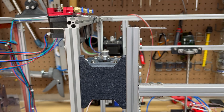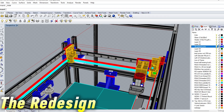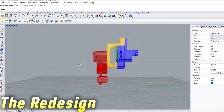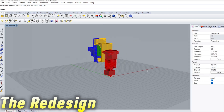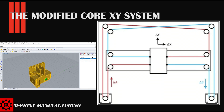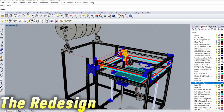The new mounts are a lot thicker and had greater gantry support from the plate that the stepper motors mount to. So when in doubt, make them thicker. With the stepper motors in place, I still had to come up with new printed mounts that would hold the linear rails in place. All the blue parts are going to be required to hold these rails to the frame and also the gears and pulleys of the Core XY system. Now our Core XY system is not what you would call traditional, but rather vertical — having the belts in the same horizontal plane, but one belt above the other. The idea was to save some space. To achieve successful parts, we would be using ASA filament, and I don't know if you're aware of this, but this filament stinks.